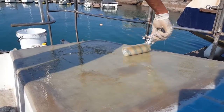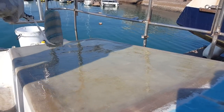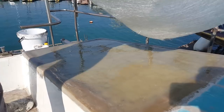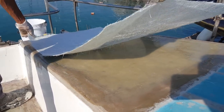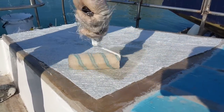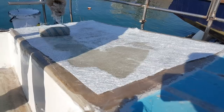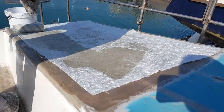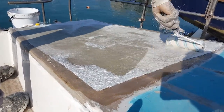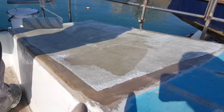Doing the build-up on this side, what you want to do is get quite a bit of resin down. Cover the whole surface area with resin and don't overdo it, but put on a good layer for the first one. Then we put the first layer of chop on, because chop absorbs resin like no tomorrow. We put that first layer on and start rolling the chop through — the first layer of resin we put down will also come up through the chop, so we work it down and up. In this case, this one only takes one chop, one bi-axle, and the bi-axle takes minimal resin — you don't want too much on the bi-axle.